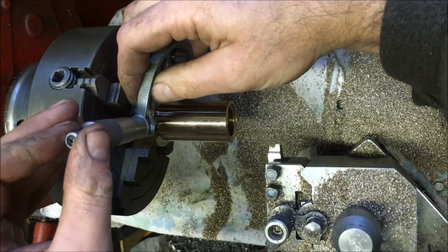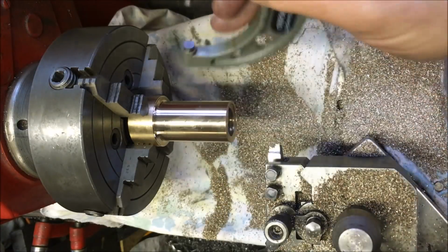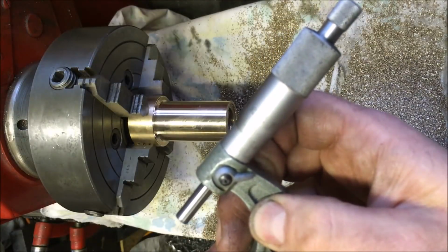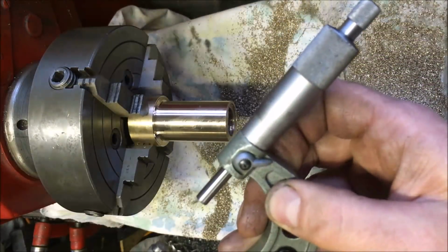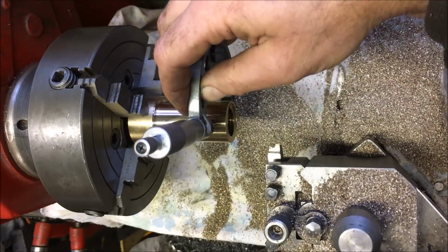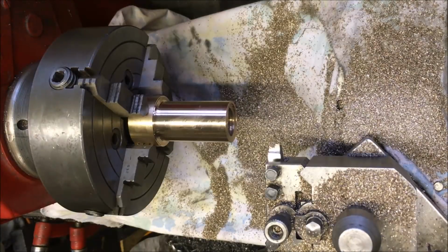So it's that. I want 32.16 and I've got, I think it's 32.18 there. Yeah, so I'm a thou up on, same there. So I'm half a thou up there and a thou up there. That's based on a dimension which was my target, a thou and a half oversized for the bore, and I'm 2.5 thou, which, given it's a press fit, it's good enough for me, I think.